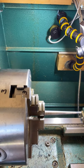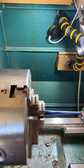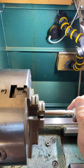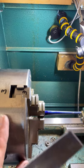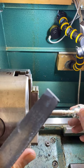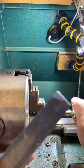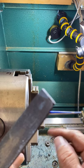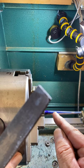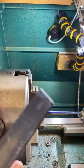Periodically, you have to clean your file. Take a strike. See where we're at. We're almost hitting my ledge. Ooh, I'm gonna have to give myself a little bit more room, looks like, maybe. Maybe not. So I'm hitting here, here, here, there, there, there, there. Looks like I have to do everything from about there to there and the very end. Nothing up here, though.